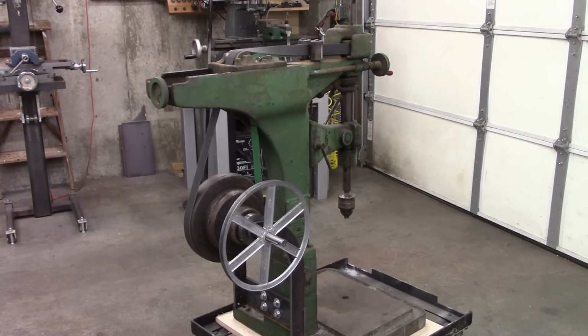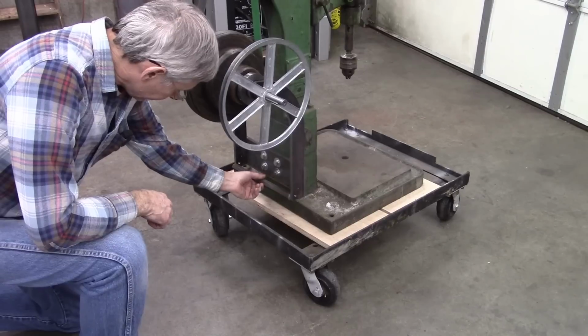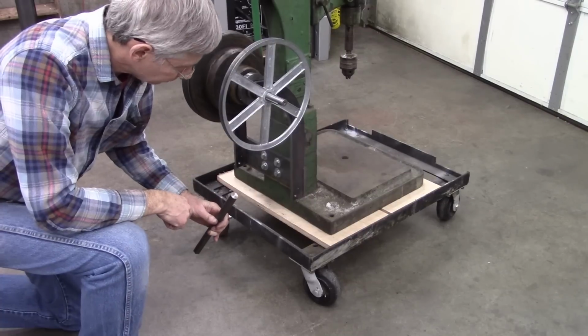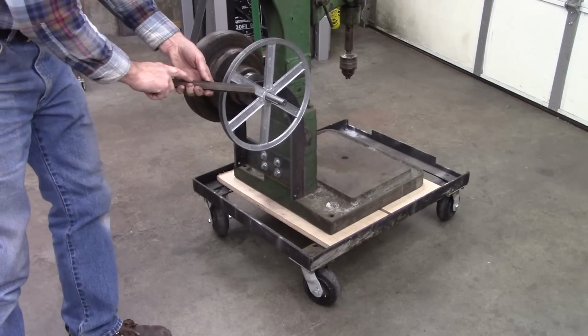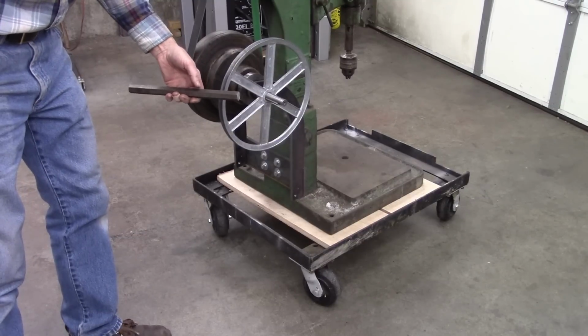Now we're going to make the motor bracket. Motor is going to be right there. I've got a piece of hex stock cut to the right width, and we're going to drill the end of it and put some 5/16 threads in there and put a couple of 3/8 shoulder bolts in. Then I'll mount a plate to that with the slots for the motor mount.